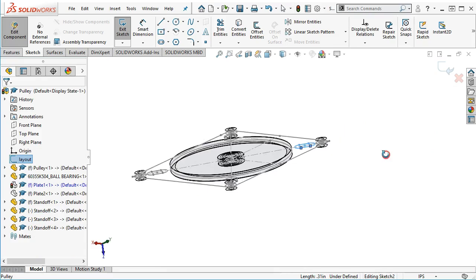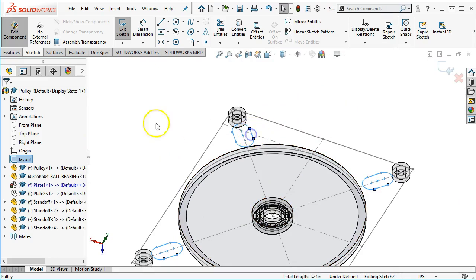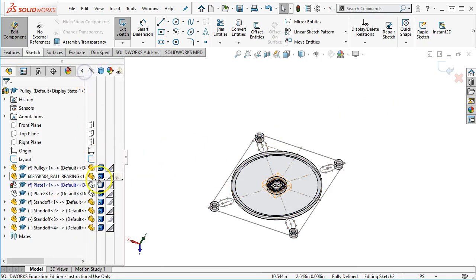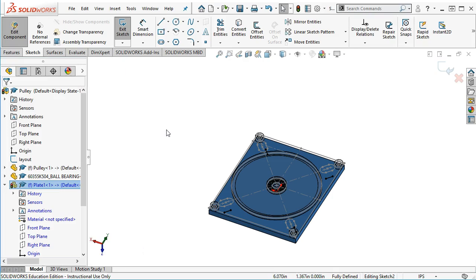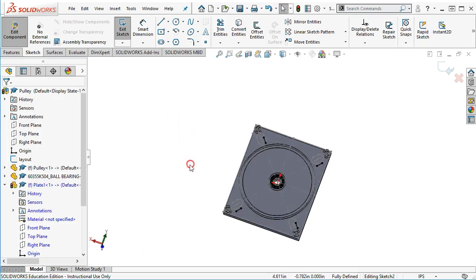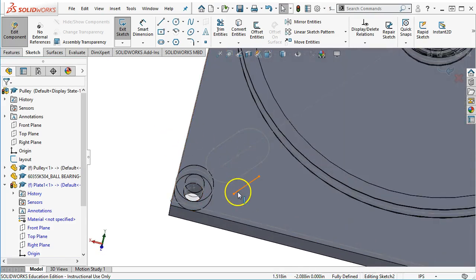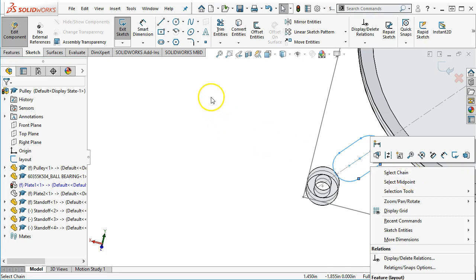So select, select, and then at the end I'm going to convert all of that geometry in because I still want a single point of reference, a single point of failure. All right, so when I come back to the plate and tell it to show, let's go expanding out the display, which is the same as, I think, hitting F8. F8 expands and contracts the display. Oh, it only picked, oh, that's neat. All right, I thought it would convert everything in. All right, maybe I don't want to do that. So it got everything.